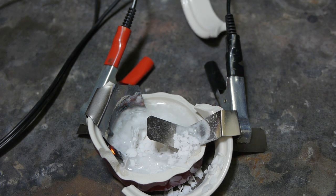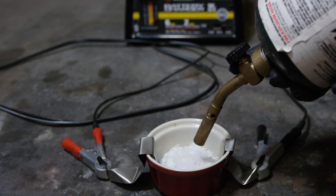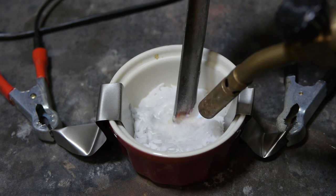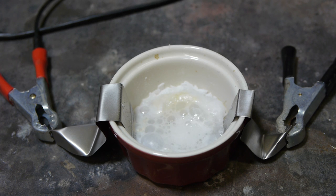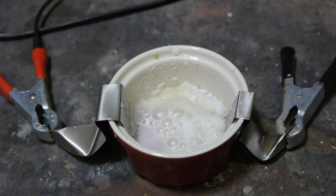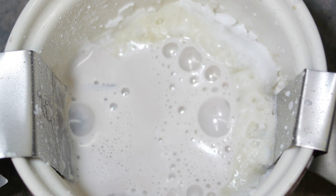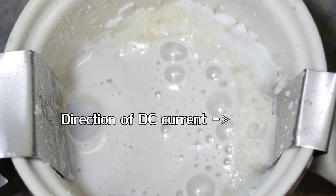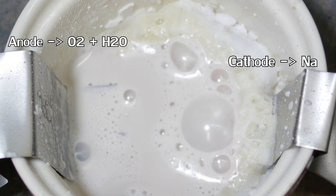The first thing I need to do is to melt some of the sodium hydroxide with a torch so that current can start flowing through it. Once electrical contact has been made, the current itself should be able to keep the sodium hydroxide molten. For my two electrodes, I'm using strips of titanium metal. My previous experience with electrolysis was that the electrodes need to be very resistant to corrosion. Titanium is typically a fair choice because it forms a protective oxide on the outside layer. Theoretically, if this experiment is working as it should, when I run a DC current through the sodium hydroxide, oxygen gas should be produced at the anode while sodium metal is produced at the cathode.